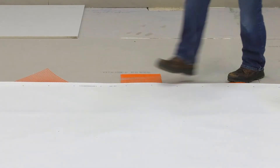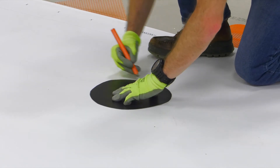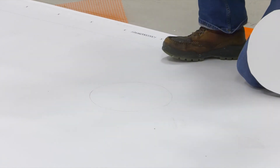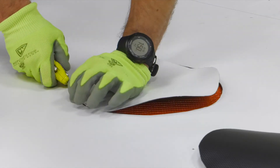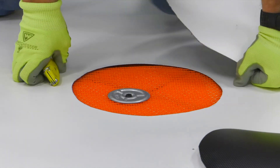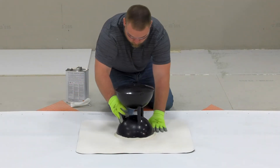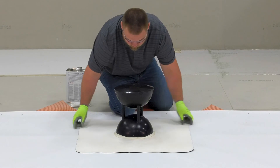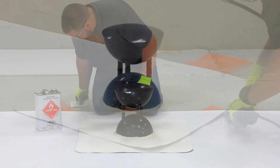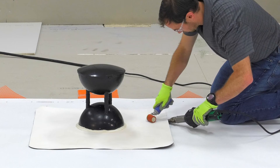As the loose-laid membrane is being kicked out, mark the location of vent placement. Next, cut a 10-inch diameter hole in the membrane centered at the vent location. Carlisle recommends creating a template using scrap membrane or tracing a pail of adhesive from the job site. After the hole is cut in the membrane, it is time to install the V2T vent. V2T vents pull air out from under the membrane and lock the roof materials into place. These vents come with a 30-inch wide pre-applied membrane skirt for easy and quick installation. Flash the V2T vent to the field membrane according to Carlisle's specification and details.